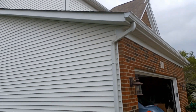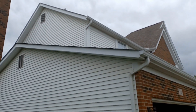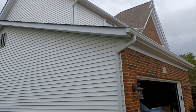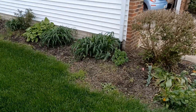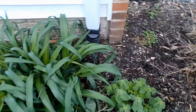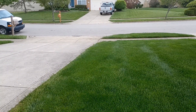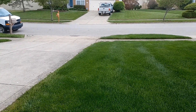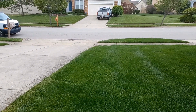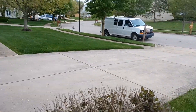So if we step back, here's the front of the house. You can see those gutters. But you also notice that the upper roof — a tremendous amount of roof — comes down and splashes across the lower gutter, and it's all coming down into this three-inch corrugated pipe. That runs all the way out to the street where the water discharges. All of these homes in Franklin County — there's a million-plus homes — they all have curb holes, and that's where water's supposed to go.